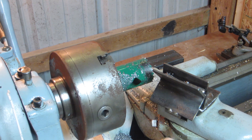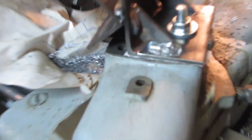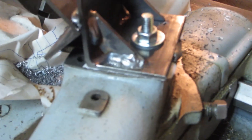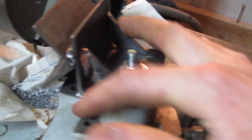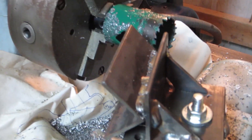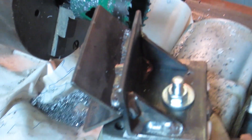As an added note, I really want to stress the whole rigidity thing. When I first made this jig I didn't have these gussets here that improve the strength of the whole thing, and without those gussets it flexed just enough to be completely inoperable — it barely cut at all, and I almost gave up on it. But I decided to try the gussets as an afterthought and the whole thing worked flawlessly after that. Any looseness or any way the tube can wiggle is a bad thing and you need to get rid of it if you want this to work.